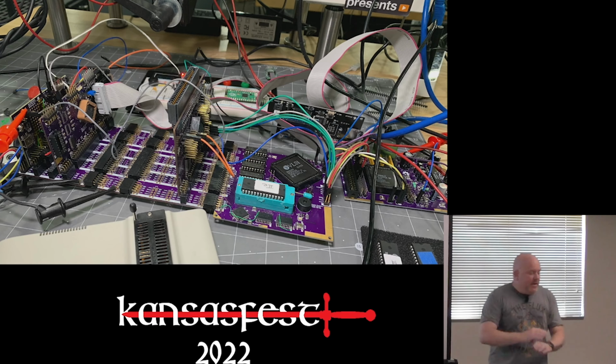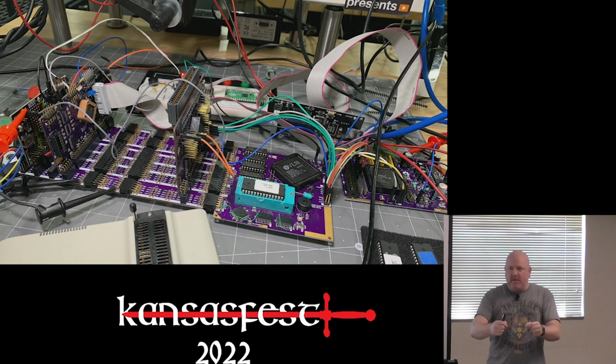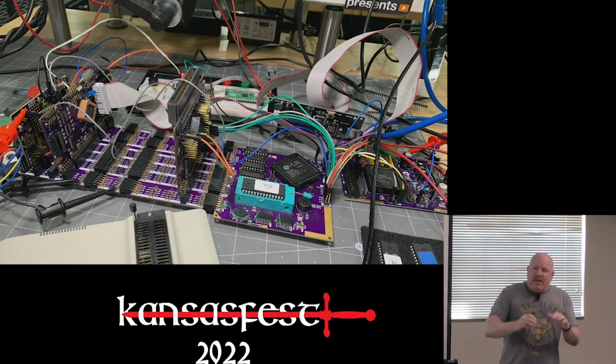In Rev 2, I went a slightly different direction. I knew the Mega-II could boot, and now it was a matter of how we could figure out all the Apple IIe functions with that chip. So I designed it as a backplane system. On the backplane, there's one connector that has all the address and data lines, one that has the clocks, and one that has all the control signals, plus a couple others I thought would be interesting, like K-select. On the right, you can see I designed a plug-in controller board, which was the Mega RAM, ROM, and CPU.